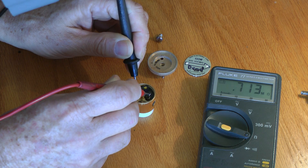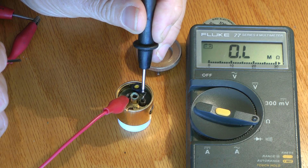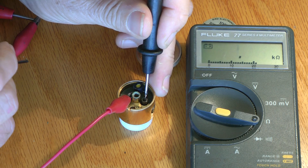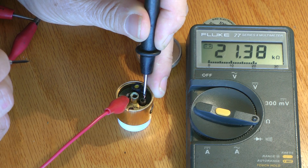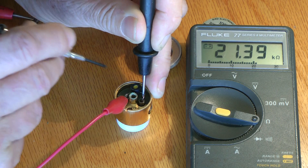After we pulled that pot out of circuit — I didn't have any spares — when we checked it again it started working again. It must have been a cold solder joint or a connection inside the potentiometer where it's fastened. We just ended up putting it back into the circuit after it started working.